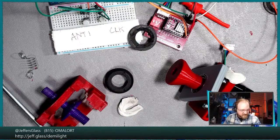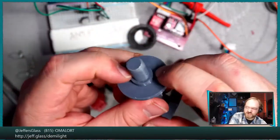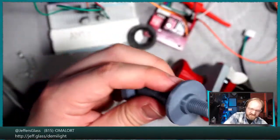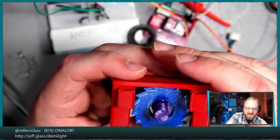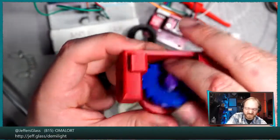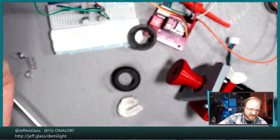So, I think when we modified this barrel, I goofed up the barrel or ratchet wheel, depending on how you want to look at it. All of the barrels so far have had this shoulder in here on which the ratchet wheel rides, right? That keeps it centered. So this is all dimensioned to fit that shoulder. But look at the newest draft of barrel. Somewhere along the way, I lost that shoulder, and so this ratchet wheel is now slipping down to hit the rest of the frame, where it should be centered on this where it actually clears everything. Well, that's frustrating, especially knowing that we just finished printing another barrel.